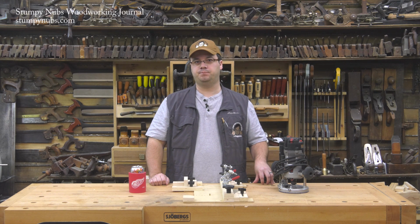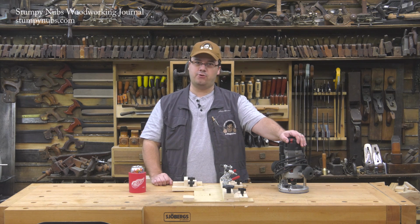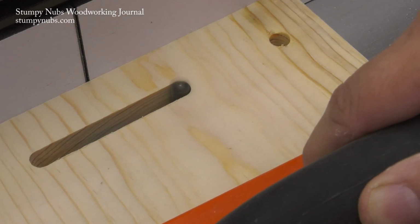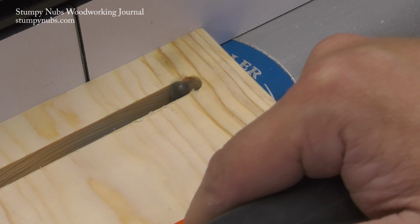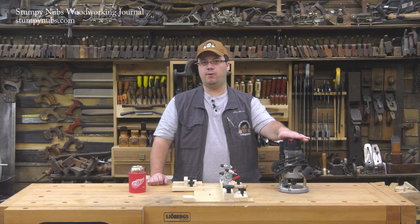that time comes. You can cut slots with a handheld router, but I prefer to use the router table whenever I can, especially if the cut is near the edge or end of a workpiece so that I can back my fence far enough away from my router bit to make the cut. It's because I find that the router table fence is faster and more accurate than the edge guide I would need to use with a handheld router.